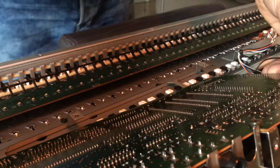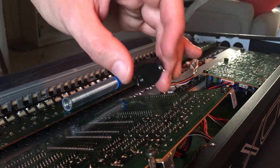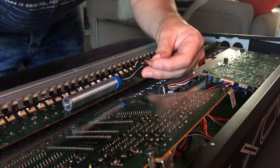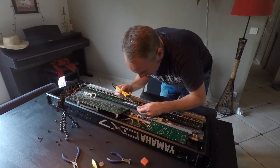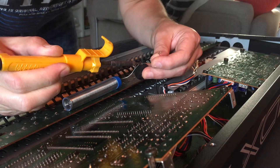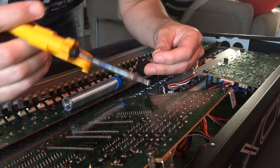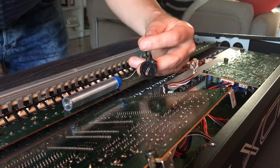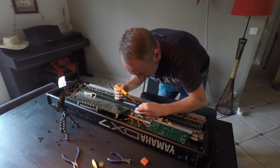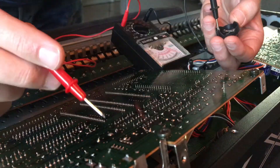Just neatly wrap the piece of wire behind before we look at the battery holder. This battery holder I got on eBay for a couple of Euros — a couple of pins on there which I've already pre-tinned. I need to solder the other ends of the headphone wire to the right place. Check your positive and negative: positive is the top of the battery where the writing is, and negative is the bottom. Looking at the holder, you can see which connector touches the top — that's positive. I'm soldering the positive there and the negative here.